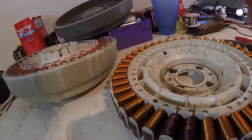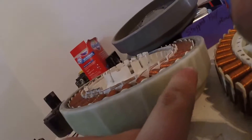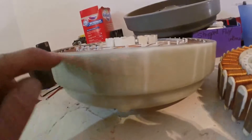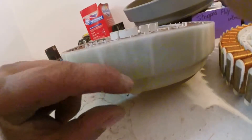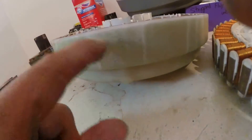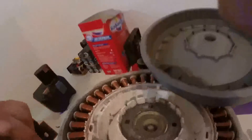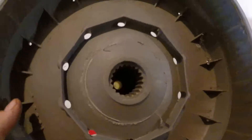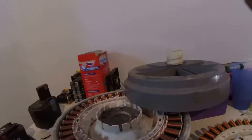The big thing with these is the outer drum spins. What I could probably do is get some HDPE plastic weld filler rods and run them around the outside here, melting them on periodically on both sides to make something like a lip each side. That way I could make it handle a belt — put a belt around the outside, then all I need is a pulley on the other end for the quad and away you go. They've also got a very good spline hub on the motor, which is really deep, and a nut that does up on the end of the standard spline shaft.